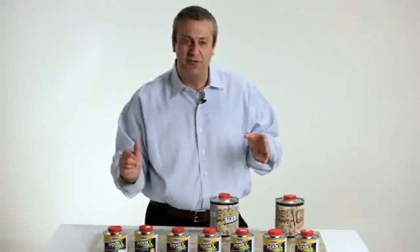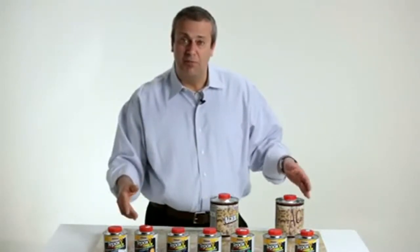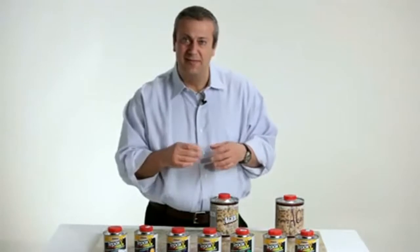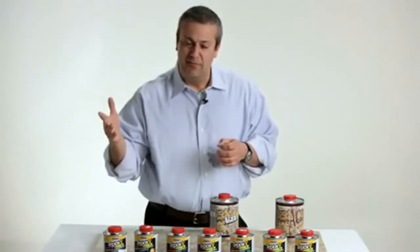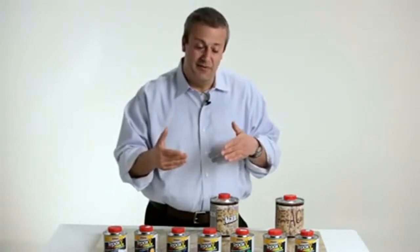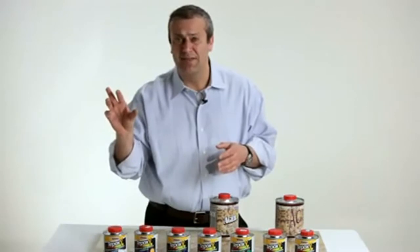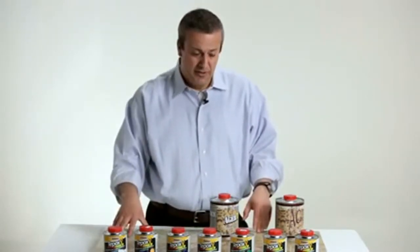Once you reach the perfect match, you can dry again and use Ager on top of that. What the Ager is going to do is make sure that the stone color stays in the stone. It doesn't bleed away. So let's say you had the 400 finish and the Tepox. At this point, you need to continue the polish. It's important that you don't go back to the same grit. So you don't go back to the 400, but you go to the 800, so that the following step doesn't remove the Tepox and the tint you applied on the edge.